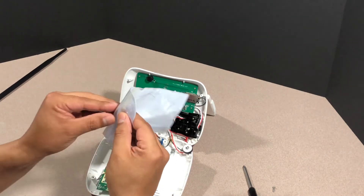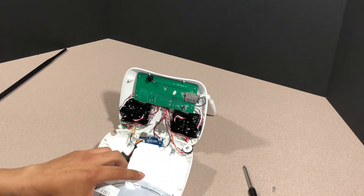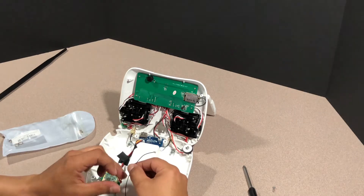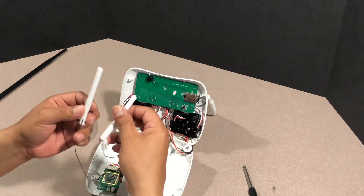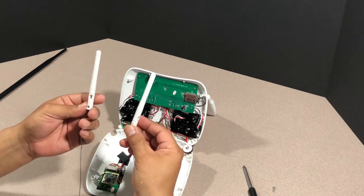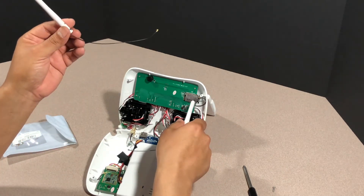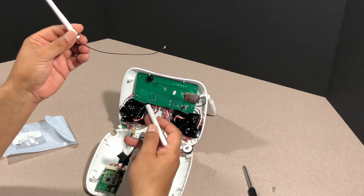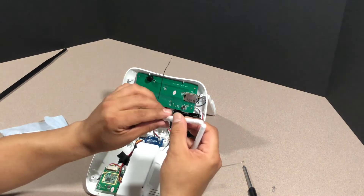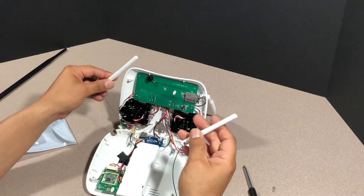Getting back to the antennas — one of the things I like about the antenna mod is that it's fairly simple due to the fact that you have pigtail connections, so they're not soldered onto the board. I kept the originals just in case I ever want to sell the drone or upgrade and hand this to somebody else — I can put the original antennas back on. I labeled them: this is your TX, and I suggest you guys do the same. Label where the TX goes, and there's only one other antenna needed so you'd know where that goes. Your TX goes to your TX 2.4 GHz chip, and the other one goes to your WiFi.